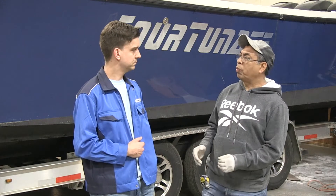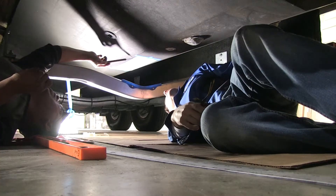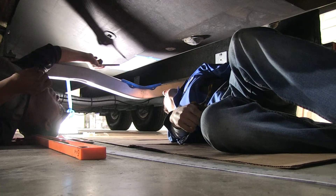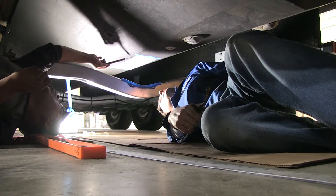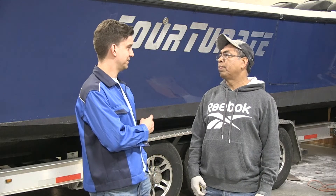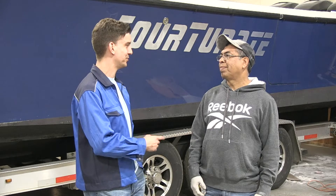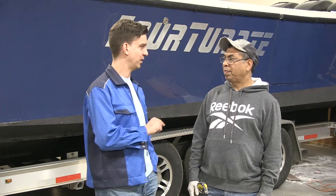The first thing is to clear whatever is in the way inside — the old transducer, bilge pump, switches, and things. Then we're going to get the dimensional drawings and go underneath to make some marks before starting the cuts. When you're cutting a hole like this, you really want to make sure you've got the right layout before you put a saw to it. Measure twice, cut once.